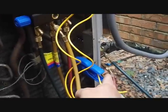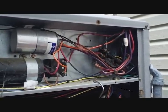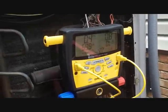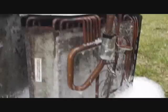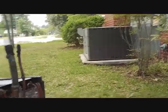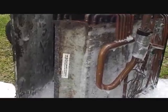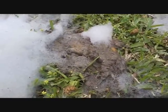We pumped the system down by shutting off the liquid service valve, then depressing the contactor with a non-conductive stick in cooling mode to pump all the refrigerant into the outdoor coil so we can pull out the indoor coil. Here's the evaporator — I'm about to spray it off with a hose and apply cleaner. I had to take the coil across the street because there wasn't enough water pressure at the daycare to use the coil gun. There's the old Trane package unit next door — I think it's the XL1200 heat pump. That's what's in our coil: disgusting.